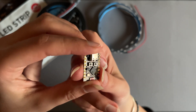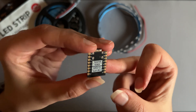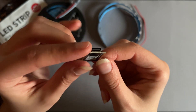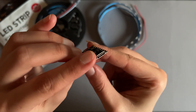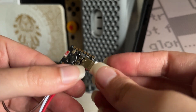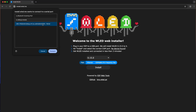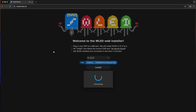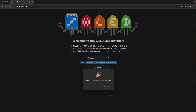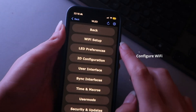For the brains of this key light, I used an ESP32C3 Super Mini — a cute little board with USB-C. I flashed the WLED firmware into it. To do that, just go to the WLED website from your browser — I had to use Chrome. Plug the ESP32 to your computer, select the device, and load the WLED firmware. You can configure your Wi-Fi settings right away, or connect your phone to the ESP32's Wi-Fi and configure them later. Then in the WLED app, search for a new device and add it.